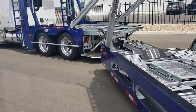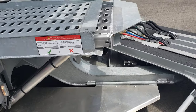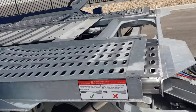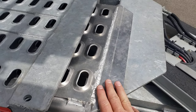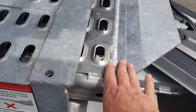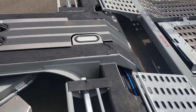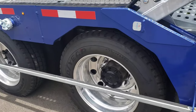We're going to the fifth wheel real quick. The bat wings are aluminum, standard fixed fifth wheel. Your fifth wheel stinger is galvanized steel as well, so you won't have issues with rusting here. This slider here — just see this as a ramp; this is not structural. This is where your structural deck ends. This is just to allow you to do a nice smooth jump to the trailer. So it's very important when you load — you've got to rest this on the trailer's cross member, otherwise you risk bending it, because it's not what it's designed for. Just little things to know with new equipment.